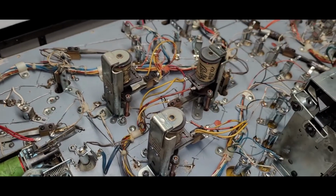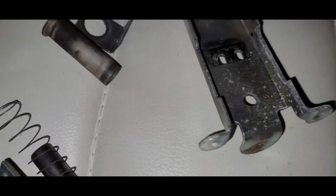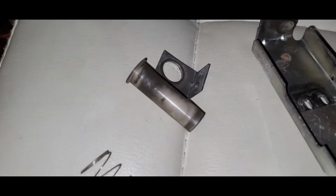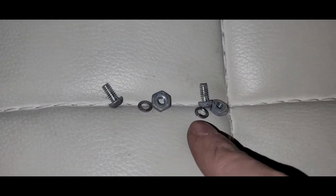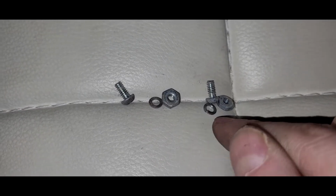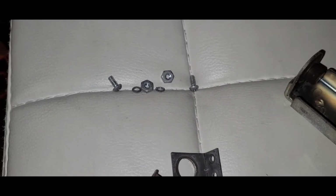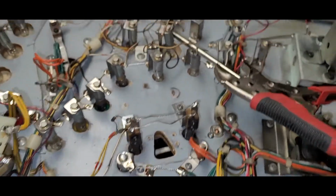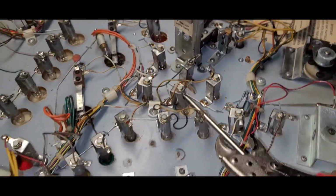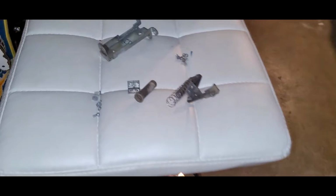Alright. Pop bumpers are probably up next. Mech number 2. Slingshot kicker. Look how nasty that sleeve is. I think this has never, ever been disassembled, because if it was, for sure these 2 lock washers would have fallen off. They were behind the nuts, and if you just take off the nuts and you don't notice, those go bye-bye. And they were not missing, so I think I'm the first one to ever disassemble the slingshot. So, cleaned up the coil, cleaned up the area around here, and then I will report back when both of these guys are cleaned up, sleeved up, and installed.